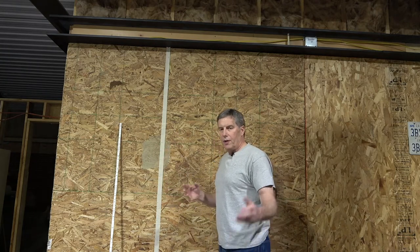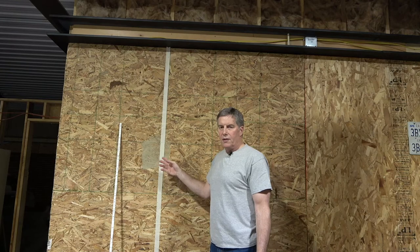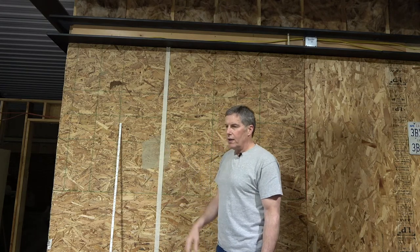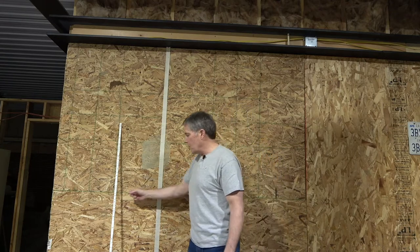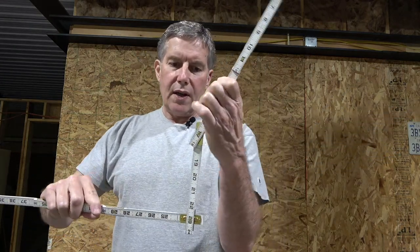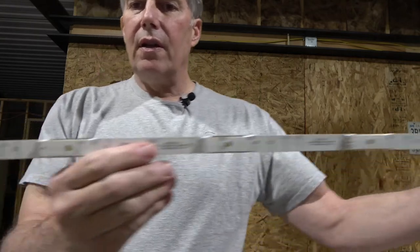I got the camera back so you can see the whole wall. I'm going to zoom in so you can see the marks. I put tape on the wall so that you can see the marks I've made — you don't need the tape, it's just to make it clearer. On the actual walls I'm doing I just use a magic marker, since some of the OSB has black ink on it and pencil marks aren't easy to see. The first tool you need is one of these folding rules that has the English system on one side and these special lines and numbers on the other.